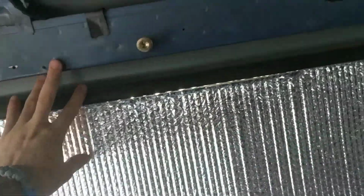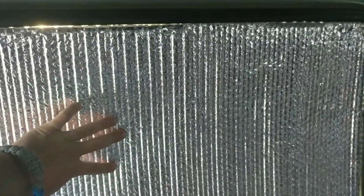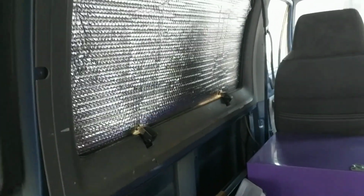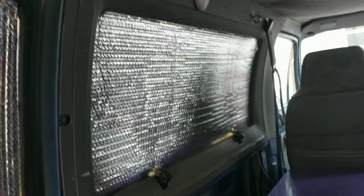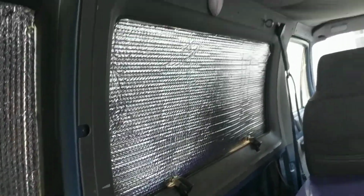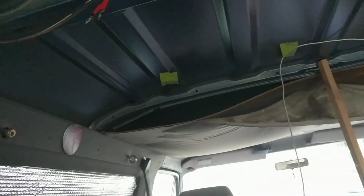I said, we're going to put insulation across this because Reflectix is designed to work with an air gap on both sides of only about 3/4 of an inch. So I can do 1 or 2 inch insulation on both sides. Still not having decided yet if we're going to do that there, since that window does open. We'll see. Definitely want to take this off though and get something nicer maybe. Yeah, I'll talk to Grandpa about it.